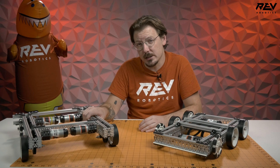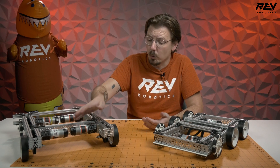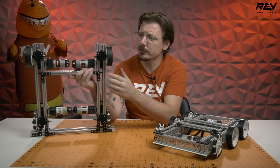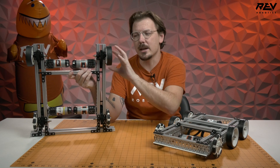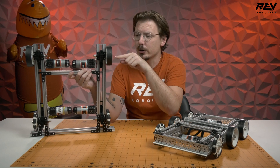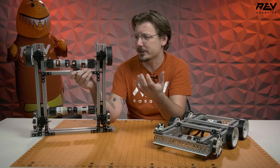This is a relatively easy chassis to build out of an FTC starter kit — we have a bunch of parts currently available in that kit. One of the first things we did is, on the bottom of our channel, we also have the slot extrusion profile. You're able to attach a couple of pillow blocks to drop the axis of rotation for the wheel a little bit lower, buying extra ground clearance because your axle is no longer running in the middle of the channel but on the bottom of it.